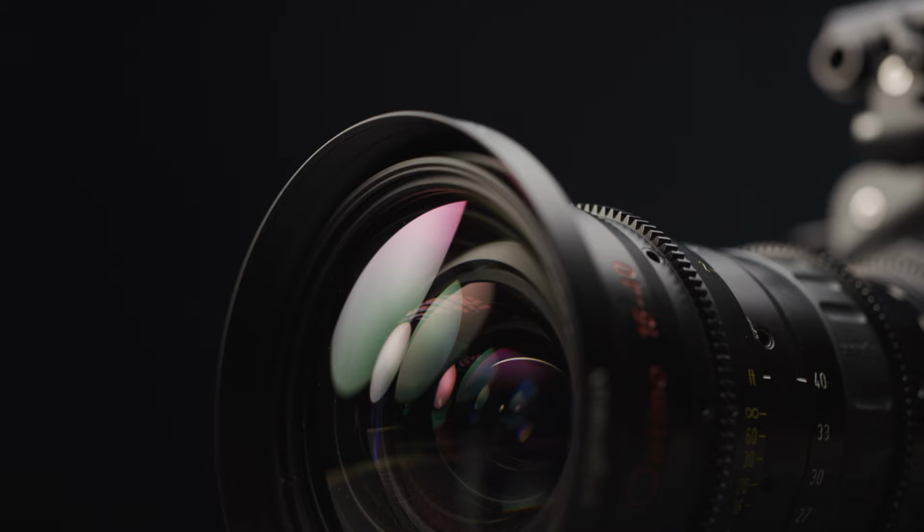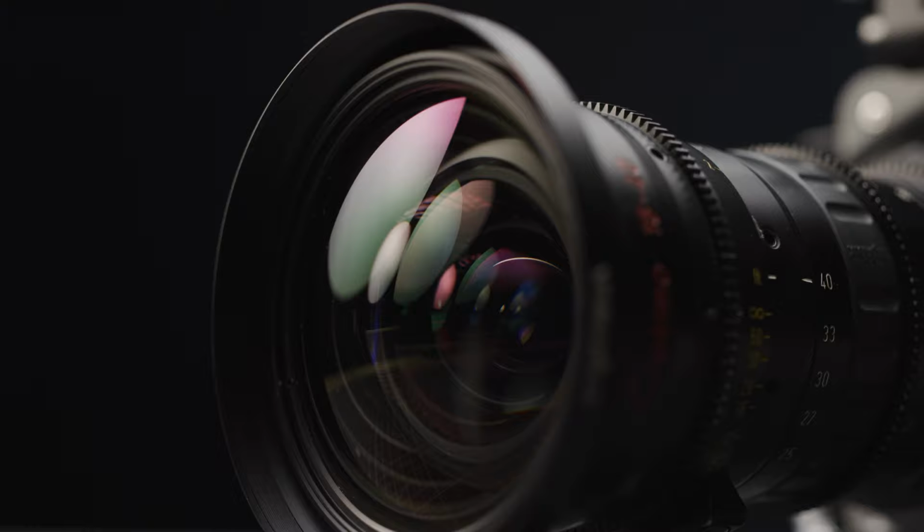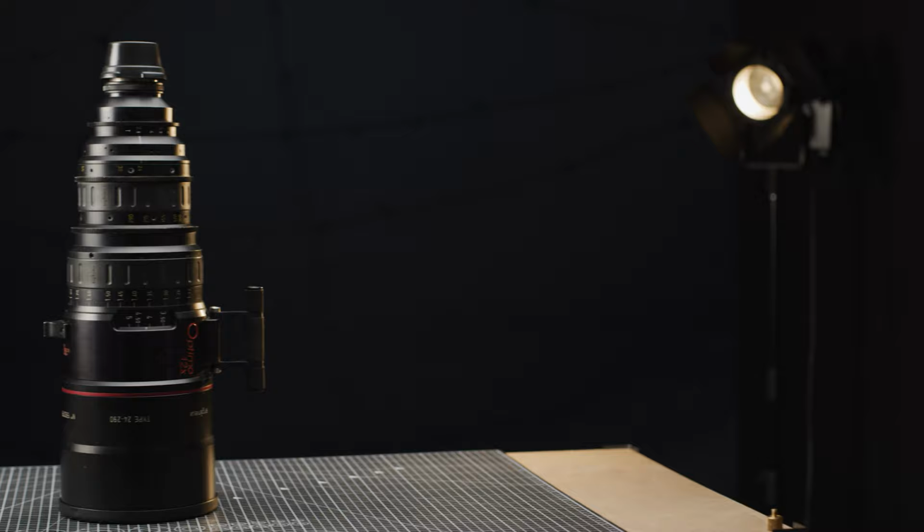All of these are important factors of a lens's performance, so when your lens or camera mount is out, this can be annoying. We get asked constantly, how many shims do I need to add to make this lens parfocal for this camera? And there is no perfect answer. This is because lens mounts on cameras can need backfocusing themselves.